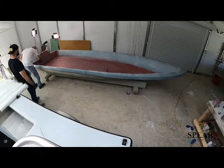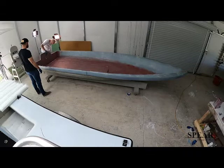Also, when you're applying the resin, I told you to just get it on there and then spread it out. When you're ridge rolling, you don't want to use a lot of pressure. You just want to push the bubbles away from the middle towards the edges, or pull the bubbles away from the middle towards the edges, and do it in a long stroke, and then come back lightly, and then do another long pull stroke or push stroke to get it out. It might look to you in the film like I'm pressing the same amount of pressure going forwards and back, but I'm not. I'm always trying to pull the resin and the bubbles from the middle back to the edge.